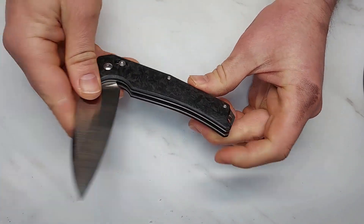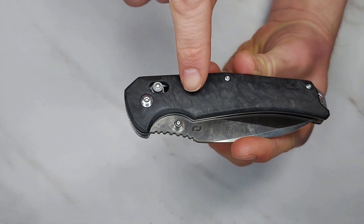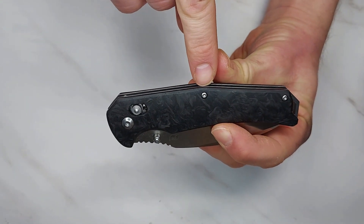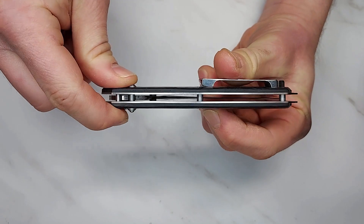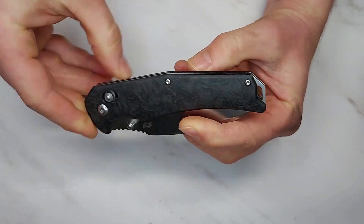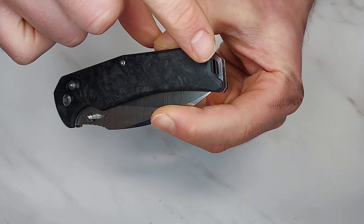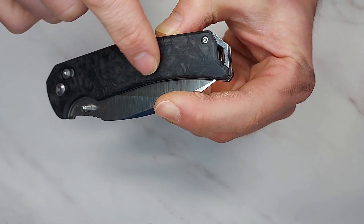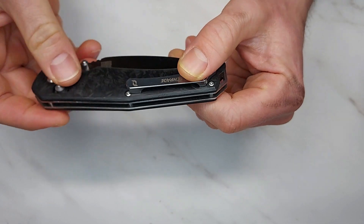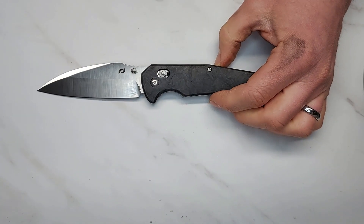You can also see, if you look at the light reflection, all that unevenness in the grinding of the carbon fiber. On the back, that seam and that beveling are not even side to side. Down here you can see all those divots — those aren't just waves in the carbon fiber, those are actually gouges into the grinding of the carbon fiber. Right away, that's a lot of problems.